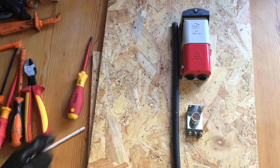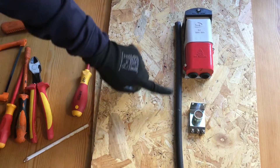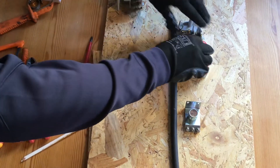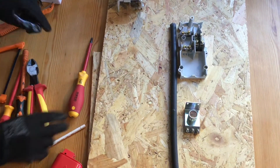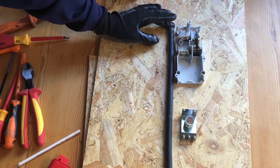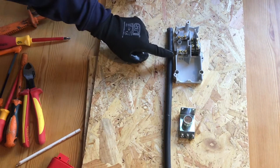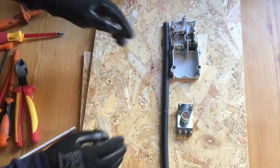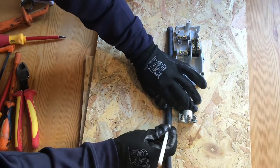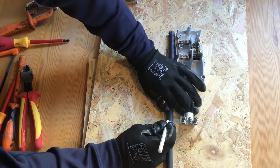The first thing I'm going to do is make the SWA off into the central earth terminal. I need to be mindful of how much conductor I need to connect into the cutout afterwards. Here you'll see we have a separated neutral earth cutout — my terminations will be here. I'm going to leave this much in slack so I can form the cables nicely. I'll get my CET and make a little mark at the bottom of the CET for starters, just there.